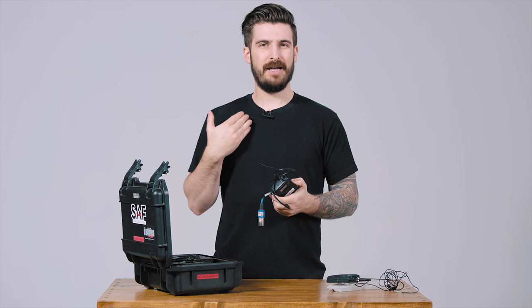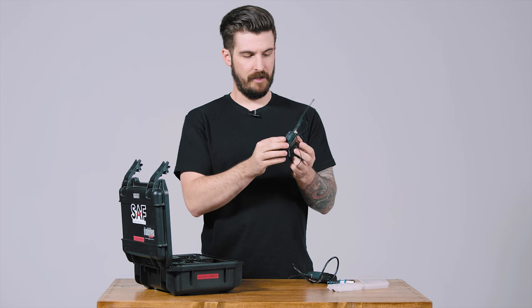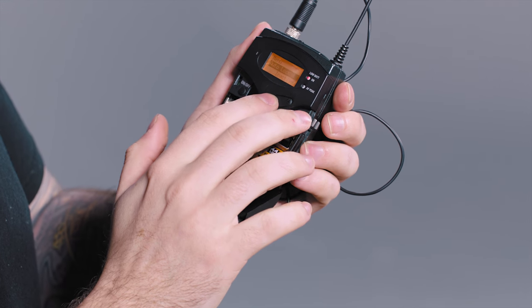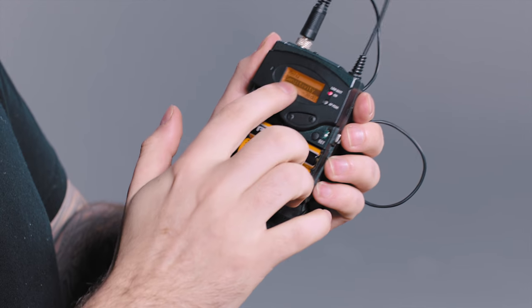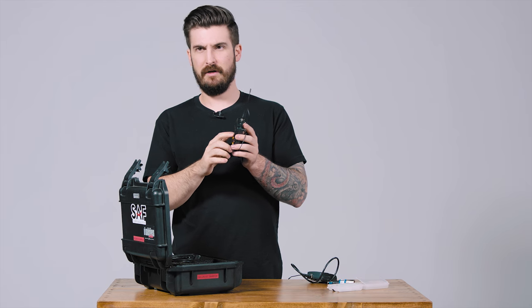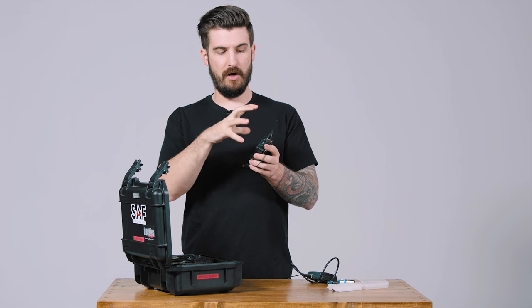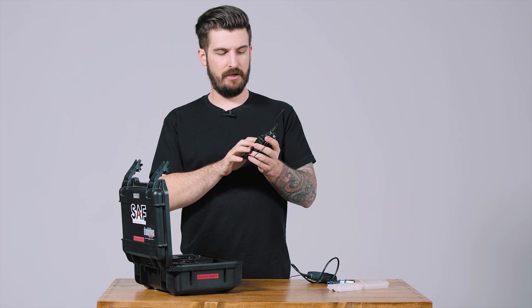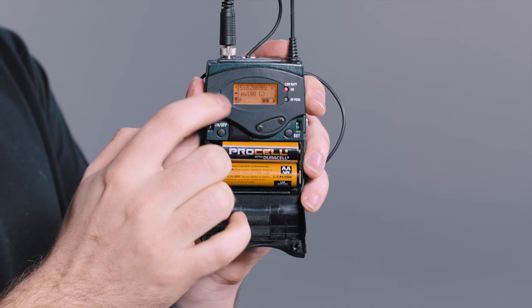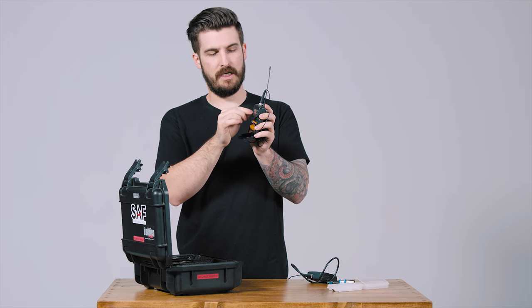Once you've figured out it's not the mic, it probably will be in your transmitter. If it's too quiet, go into the menu — it will not be under Advanced, it will be under Sensitivity. Just hit that and adjust as needed. Next to your display there is an AF Peak light, and that will go off when you're peaking on your transmitter. Once you get out of the menu you will see a little levels indicator off to the left — that's your first indication of whether or not you're transmitting correctly.